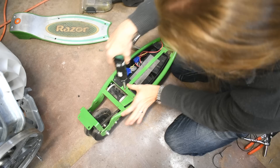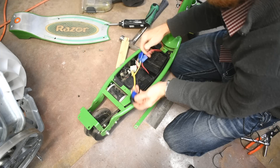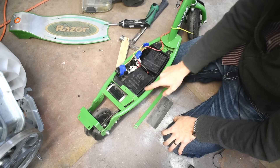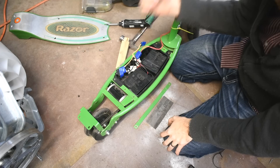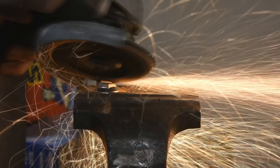So it took me a while to figure out how to make this thing work on a washing machine. I took it apart, took all the junk out of it, including the rigged-up wiring with the crappy blue electrical tape. By the way, I never fell off the scooter, but I also only rode it about 50 feet — partly because I'm a grown man and riding a kid's scooter is kind of weird, but also because I'm too cowardly. This is a DC motor and it's easy to handle speed control on DC motors — it's just voltage. More voltage is more power, less voltage is less power. It's not so easy on an AC motor, but I don't have an AC powered scooter. Of course I don't have a way to throttle the voltage other than connecting and disconnecting more batteries, so put a pin in that for the future.